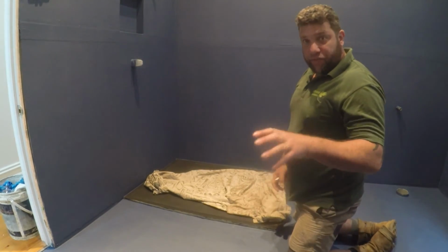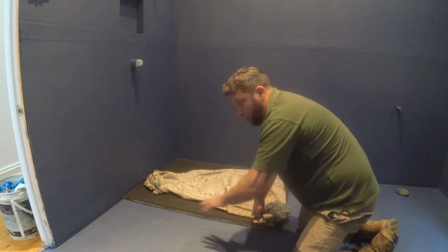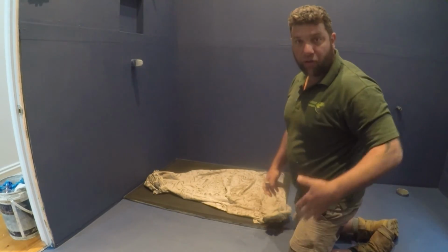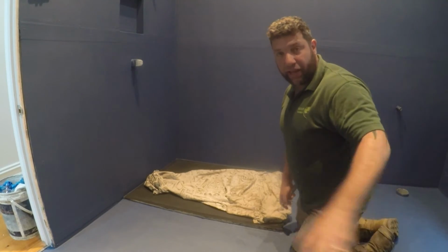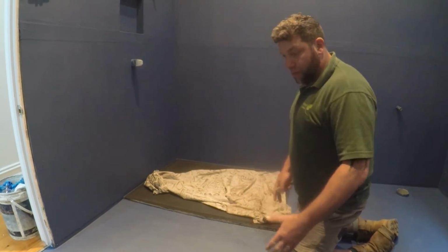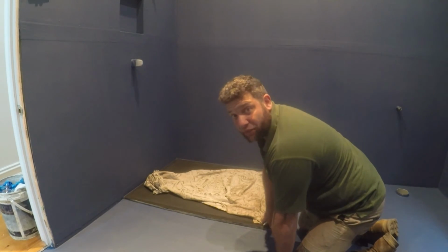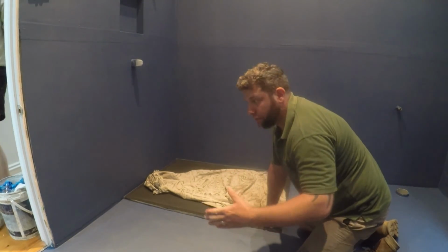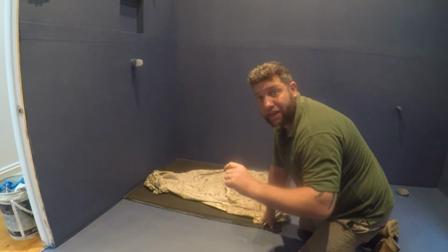The next stage of this area is to actually do a layout. So I want to make sure that my measurements from the shower base are really good, and the measurements over the entire wall are really good. So I'll show you that as I go, setting out a laser level, getting all of our corners right, double checking, triple checking all of our measurements, and making sure everything just blends in really well to make the end product nice and even. We don't want any of the walls out of plumb. We don't want any really big cuts.